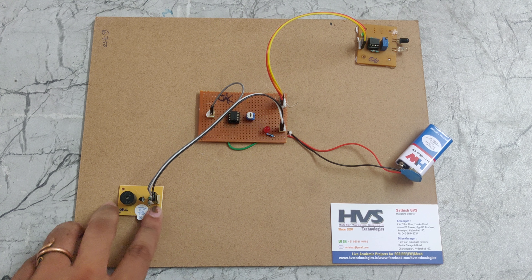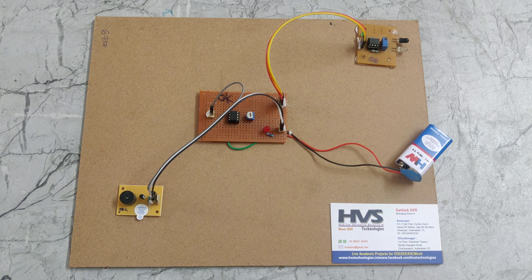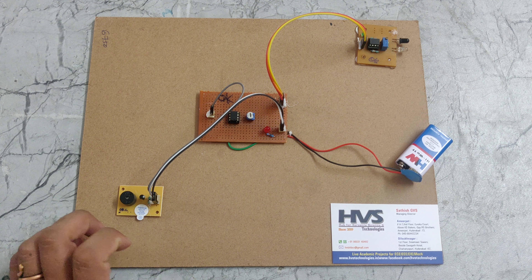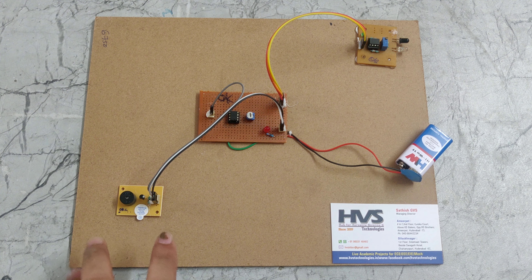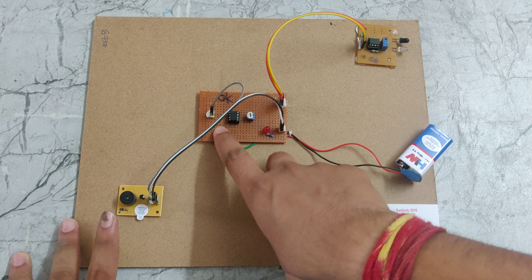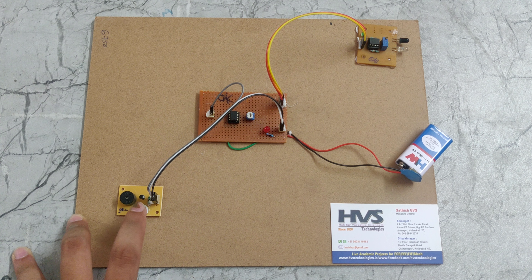In the piezo buzzer board, we can see a transistor which is connected as an NPN transistor. Whenever the base is triggered with a signal — here we can see the output of the LM258 — that output will be given to the transistor base. Whenever the base receives a 5-volt signal, it will activate a buzzer alert.